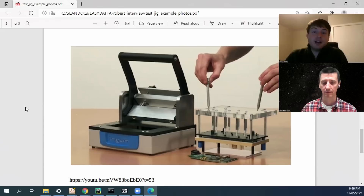Other things to test via test points: microphone and speaker. I've actually seen a microphone tested — we applied a speaker from the test board, made a housing around the microphone, ran through a progression of tones, and made sure the micro picked up those tones at the correct frequency. You can also play tones to test the speaker output.